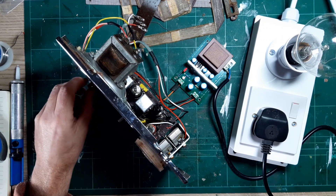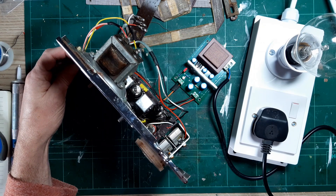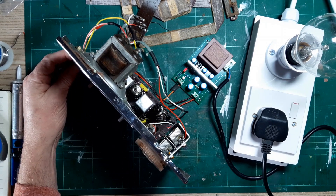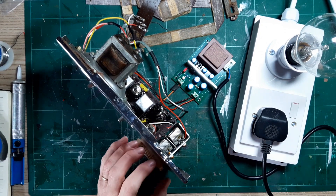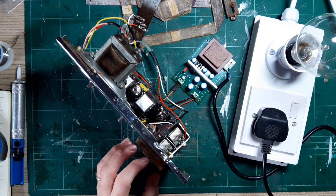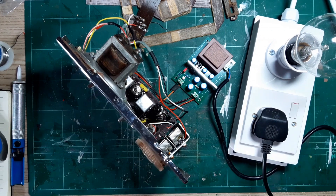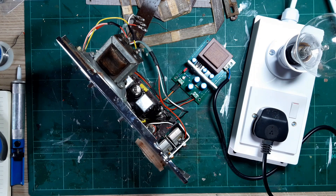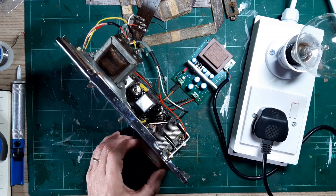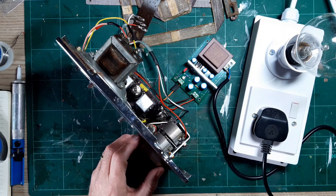There's really not a lot — you won't hear it on camera but there is just a hum, which tells me the switch is working. So that's something I need to look at now. I was hoping it was just going to work, but my strategy now would be to have a closer look at the printed circuit board and circuitry to make sure nothing's disconnected or broken. I'll probably need to test the valves too, and I'll backtrack from the audio stages to the RF stages to find out why I'm not getting any sound. There's not enough crackle in this radio for me to be happy that it's actually working.